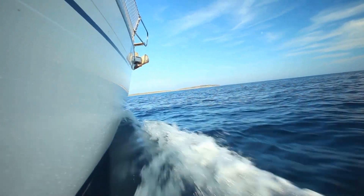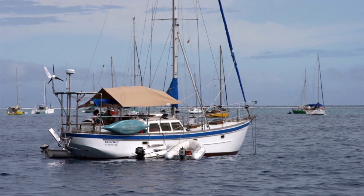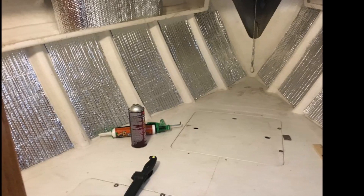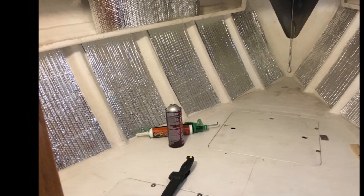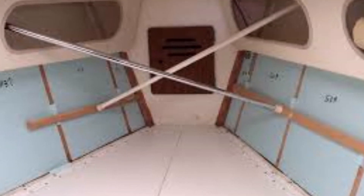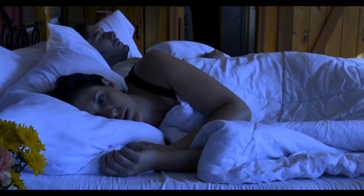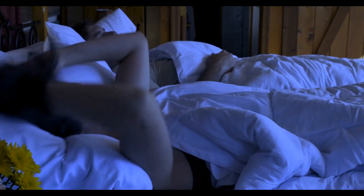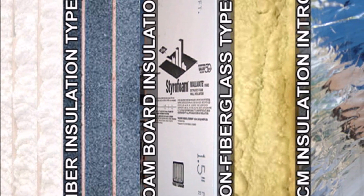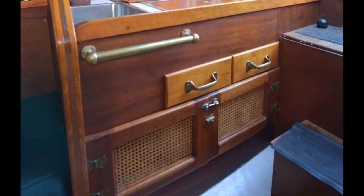The next way to help cool the inside is to cool the outside. A light-colored deck and hull is cooler than a dark-colored one, and keeping the sun off the deck using awnings also helps cool a lot. Another way is to keep the heat out through insulation. If possible, it's always worthwhile to insulate your boat — not only does this help keep the boat cool, but it helps prevent condensation. Condensation happens mainly when there's a temperature difference between inside and outside, and is worst on shoulder seasons with hot days and cold nights. Try to avoid natural insulations that easily grow mold and mildew. Any enclosed spaces inside the boat, like under benches, should also be vented to keep moisture from building up.